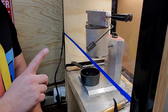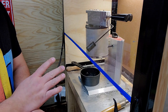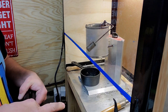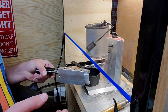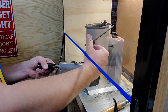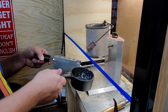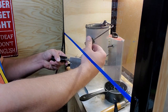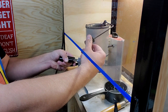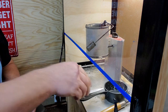So I took the mold, put it on top of the lead pot to heat up, just to give it some ample heat. Then I also resprayed the inside with dropout again, just to give it a fresh coat. I'm having some problems with the cavities filling in, so heat and dropout should do the trick. One thing we gotta remember though is to keep the lead flowing consistently and very close to the mold, but try not to let it run next to the... It needs to hit that sprue and go all the way down in.